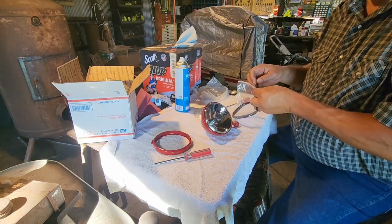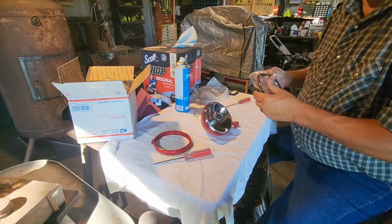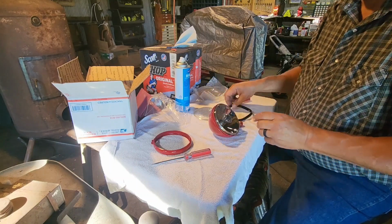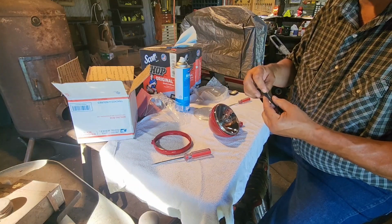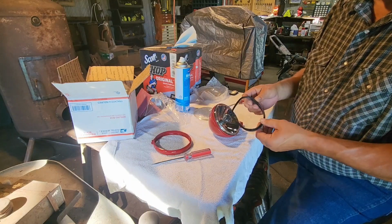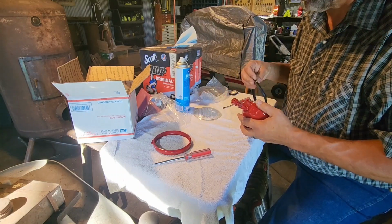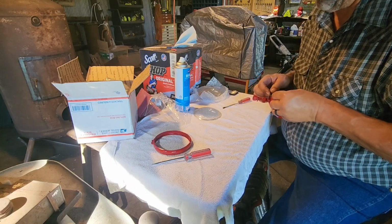So now comes the gasket. And the gasket kind of goes over the top of the rim of the light and hooks over into this groove here. And then the gasket has a seam in it right there with a staple through. So we're going to put that on the bottom. So if we get any leaks or anything, they'll be on the bottom down here. Once the outer cover is on, it shouldn't matter too much. But it just seems like we should do it that way.